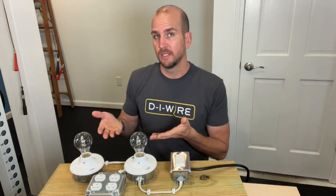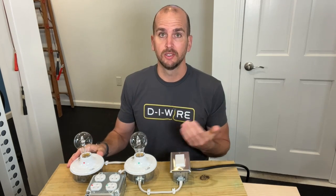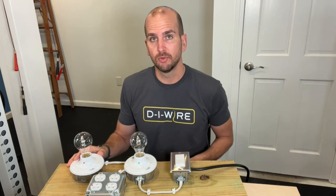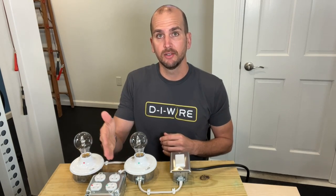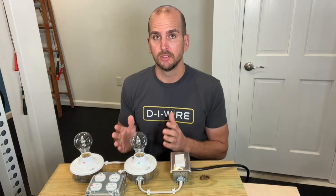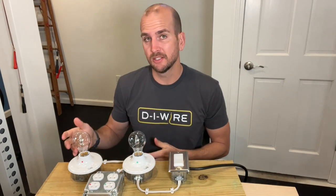From the outside you can't really notice anything, but the one with reverse polarity, although it looks good, has a safety issue that you want to avoid. I also added a couple duplex outlets — again correctly wired and incorrectly wired — so we can demonstrate with some simple tools and a little knowledge how you can go around your house and make sure everything is wired correctly, so you don't unknowingly have an unsafe scenario where something as simple as changing out this light bulb might give you an unwanted surprise.